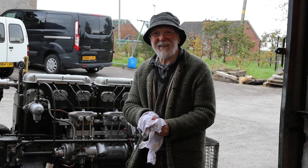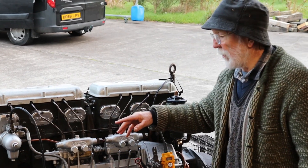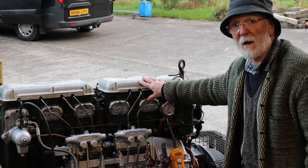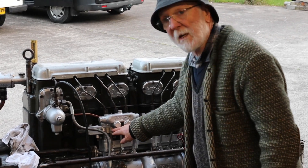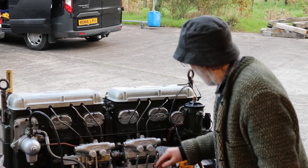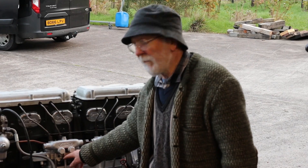It's only an experiment — just a bit of fun. I've decompressed the back block. So now, whenever she tries to run on one or two cylinders, she's not having to compress the air — she's just dragging the pistons round without any load on them. We can then latch down two levers and measure one cylinder, measure cylinders 1, 2, and 3, and then do the same with the front block and measure 4, 5, and 6. It's unreasonable to ask her to start on one perhaps, although I confess I haven't tried it. So we'll start her on two and latch this one down to see what RPM she'll come to.